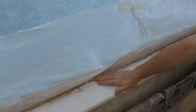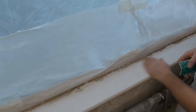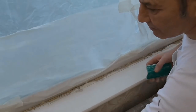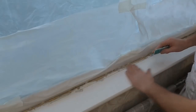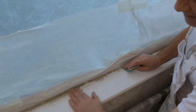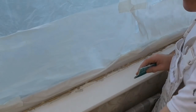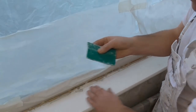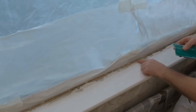Get all this vacuumed off. And once you've removed all that sealant, and all this back edge and anywhere where it started to flake this way, I can give a really good sand. Mostly concentrating on this edge. I don't really want to go into this too heavy because this is a P60, so it's quite rough. Again, I just want to concentrate on these areas.